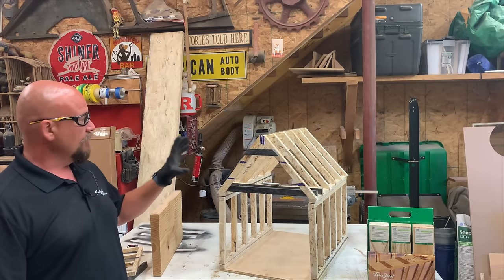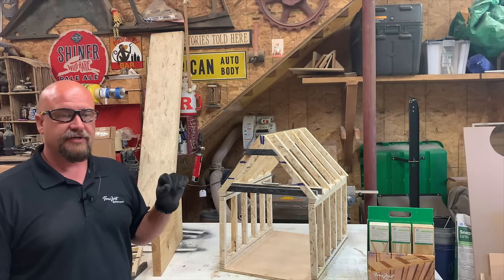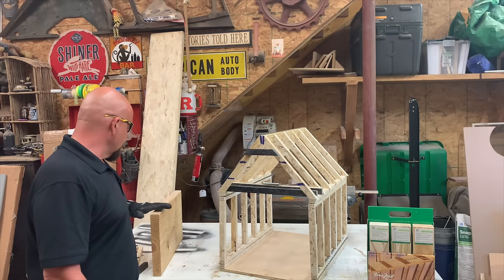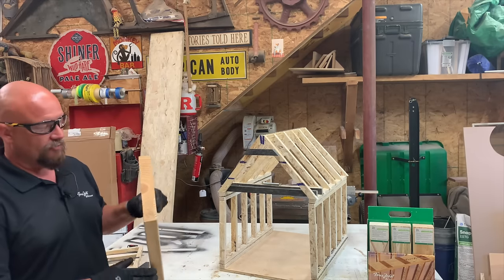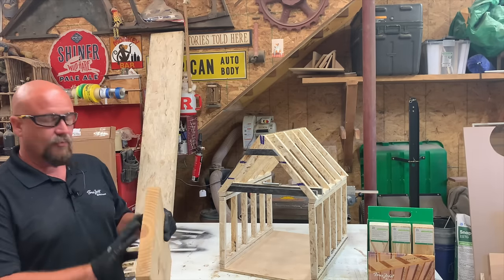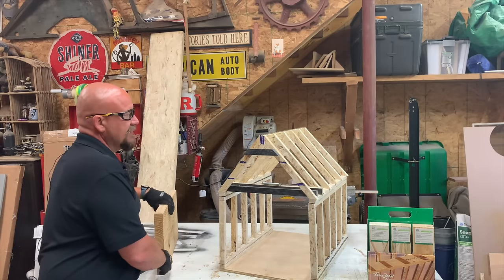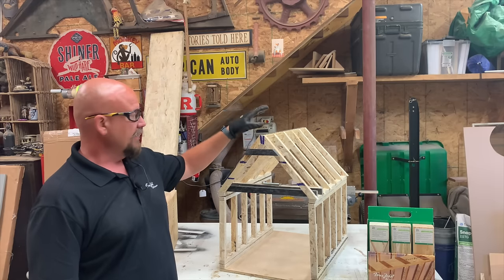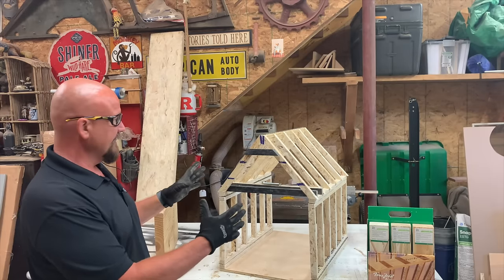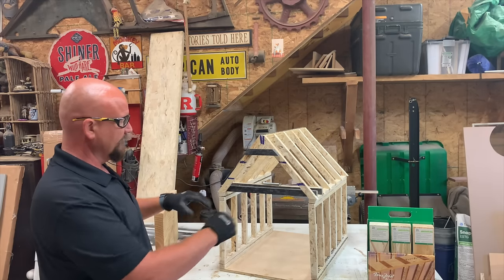The ridge board, or the compression-style roof, follows Chapter 8 of the 2018 IRC. Typically in a compression-style roof, which is what many houses have been built with over the years, you'll see a single member — usually a 2x10 or 2x12 — with rafters going into it and attaching down to your walls. You may even see a single piece of LVL microlam in this position as a ridge board. The difference is how the structure is being held together.